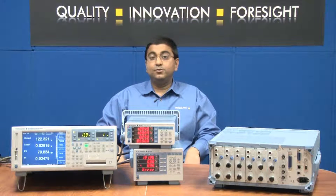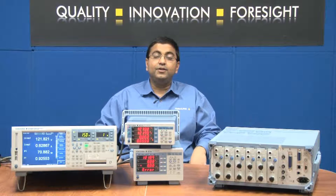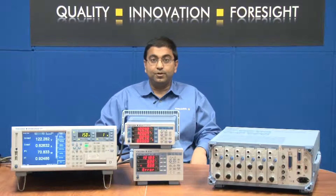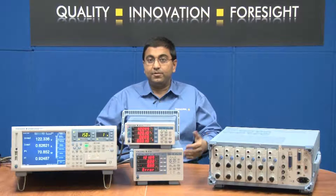The second method uses voltage measured across an external shunt that is then applied to the external current sensor input of the power analyzer, which can then be scaled to make your current measurements.